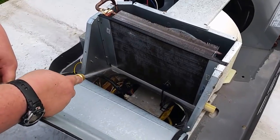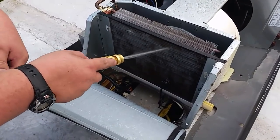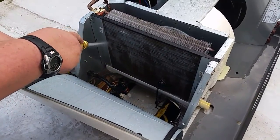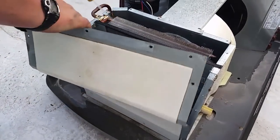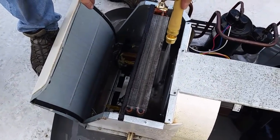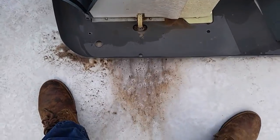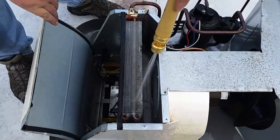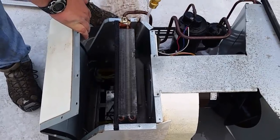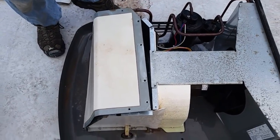I may do another application on this one — it's pretty good but not all the way there. You've got to be really careful: there's electrical boxes down in there that you don't really want to hose down a whole lot. Also, this is a good chance to clean out the dirt dauber nests that are in there — let them dissolve out the mud and rinse them out. Make sure you've got good air flow through everything. It's probably pretty well rinsed for this round, so we're going to do another round to get the coil clean.